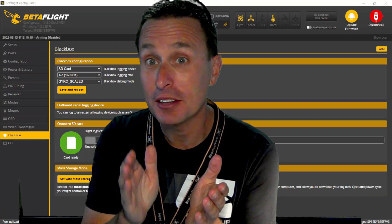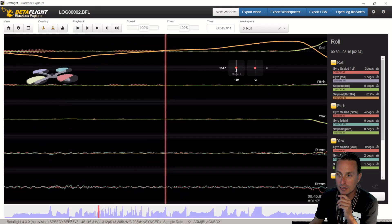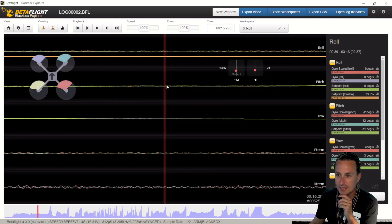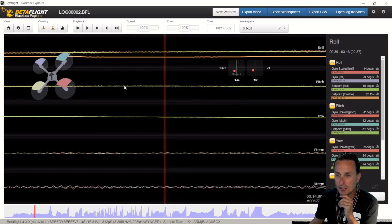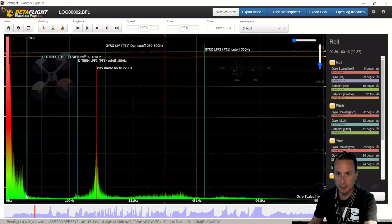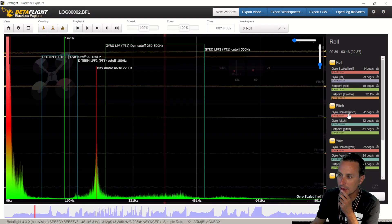I'm back from the flight test — let's see what we got. First thing is just look at that: a couple of logs on here, 464 megs of flash remaining. All we have to do is hit activate mass storage and click on the log. Looking at the little red lines — she's looking good. I can hardly see the little red lines behind the smooth gyro traces. Let's hit gyro scale — oh yeah, buddy. That's the good stuff. Like 50 to almost 200 hertz here, barely any noise, and then there's the motor noise band up there, but nothing abnormal. Everything looks in good order.